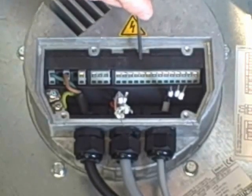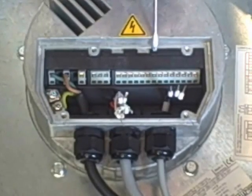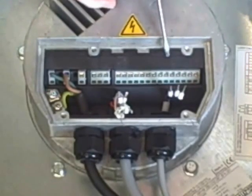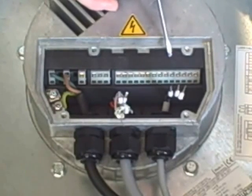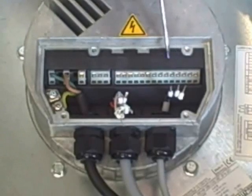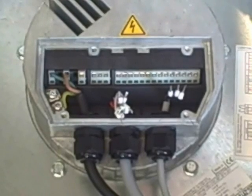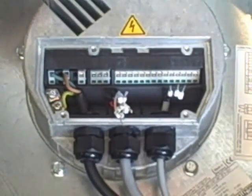Analog two has a ground, a zero to 10 input signal, and a 24-volt control. Then moving over you'll have your enable switch with your 24-volt and enable terminals, then your output voltages — an output and a ground. You'd only use these if you were going to tie two fans in line, using fan one as master and fan two as slave. Then your last four are your RS connectors for hooking up your RS-485 to USB port to operate and monitor this fan on your laptop or computer.